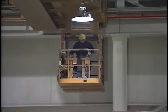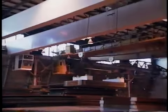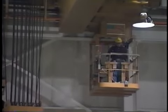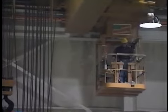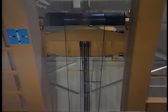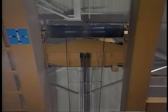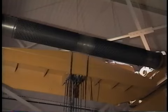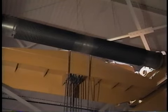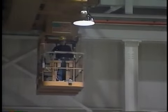Although there are many kinds of lifting attachments, this program will focus on three: the hook, the bucket attachment, and the magnetic attachment. No matter which attachment is used, proper lifting requires that the operator position the crane so that the center lines of the bridge and trolley are directly above the center of the load. If the bridge or trolley are positioned off-center, side pulling will result when the load is hoisted. Side pulling almost always causes the load to swing, which reduces operator control and may result in injuries to personnel or damage to property. Side pulling may also damage crane ropes and drums. In severe cases, it may cause the rope to jump the sheave grooves, causing damage to the sheave, shaft, bearings, and rope. To prevent side pulling, the bridge and trolley must be positioned directly over the center of the load.